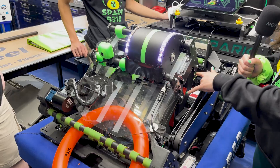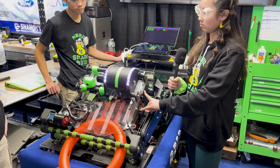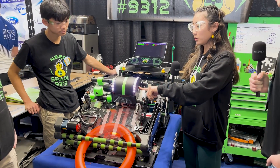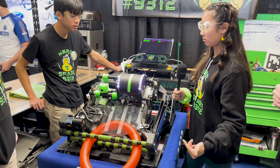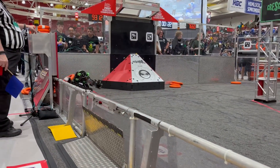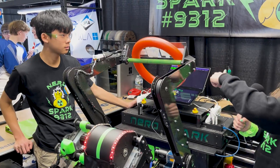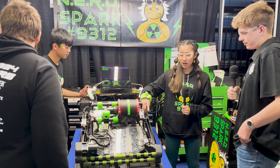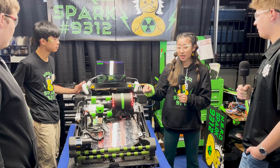We have this four-bar that moves in and out to get straight from the ground up to our position to shoot into the speaker. We have these metal plates and polycarbonate that connect the shooter, and we have two NEO Vortexes at a one-to-one gear ratio connected to four-inch flywheels. Once our driver wants to shoot, we push the ring through with the intake and it catches the flywheels and shoots off to the speaker. When we want to do amp, we have this arm that traverses over so we can push it in to score it. The four-bar allows us to change the angle of our shooter based on where we are — we use vision and the AprilTags to figure out the exact angle we need, and then we can just shoot.